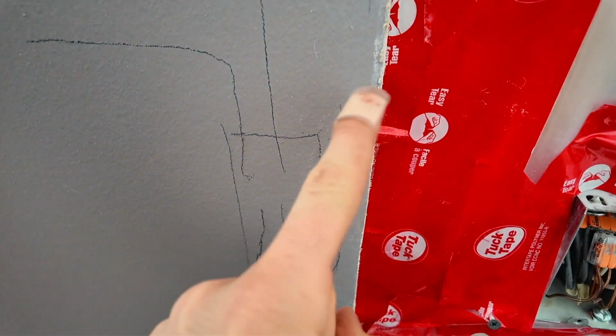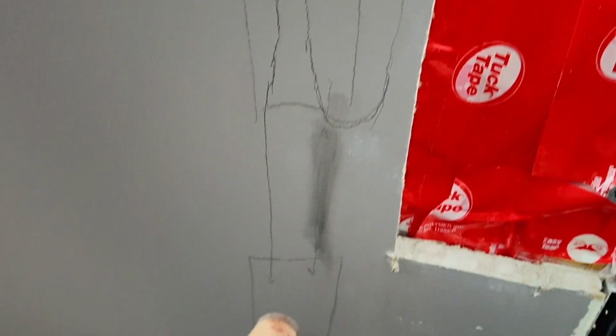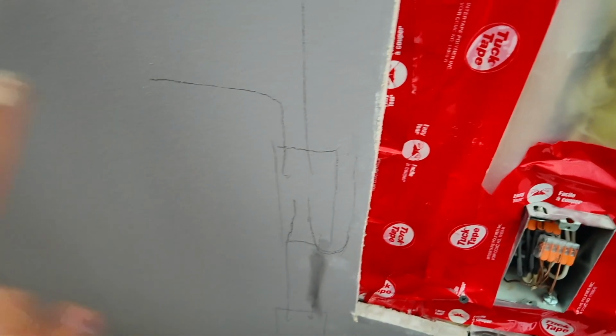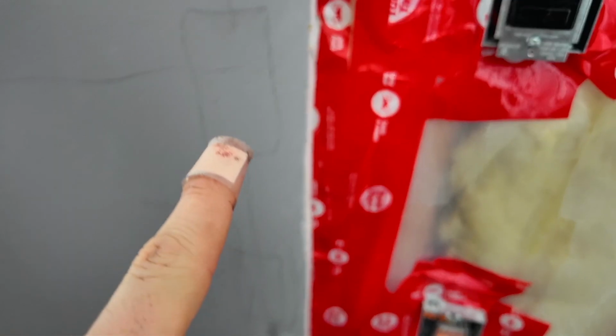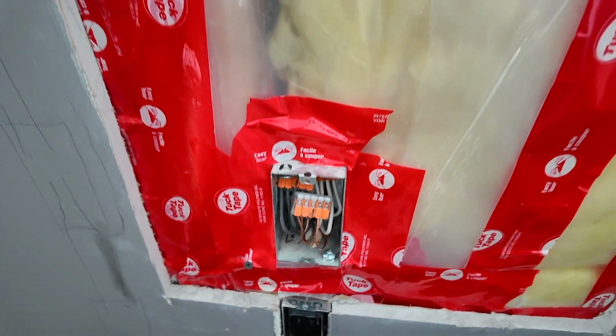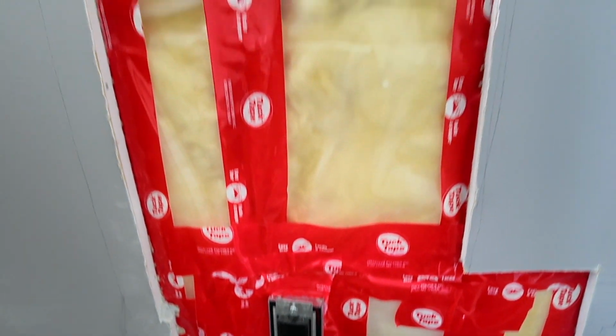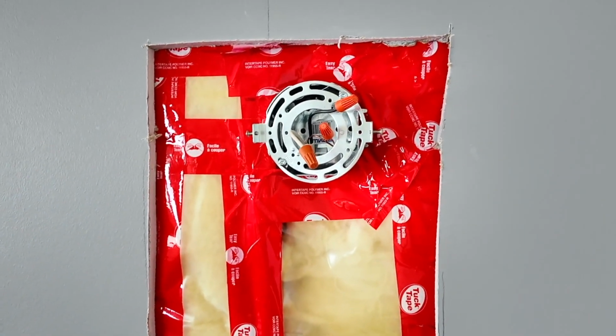So there's basically 4 wires. It kind of looks like this, where the one main power wire goes in, one new power wire goes down to the outlet, the other wire continues on its path, the other wire goes up to a switch, which then continues to the light. So you can see junction box, wire goes up, I stapled it, resealed it. This is the switch for the light, which goes above our bedstand, and that's the box now for that.